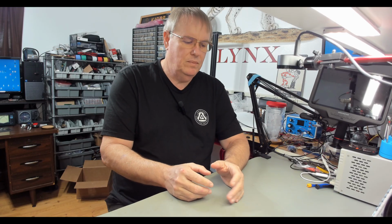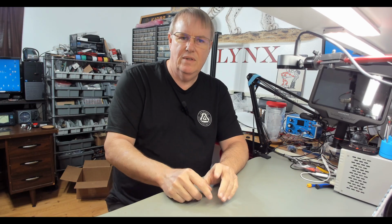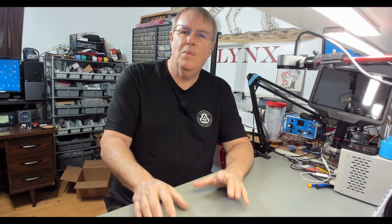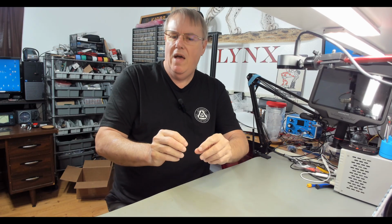So the first thing to point out is the big debate is whether, when you put an antenna tuner in your system, you've got your radio, your antenna tuner, and your coax and your antenna, and your antenna is not resonant, and you tune your antenna tuner, there are people who believe that the antenna and coax changes because of the tuner. It makes a conjugate match that causes the antenna system, coax and antenna, to be resonant, meaning it is 50 ohms resistive, and that's all. There is no inductive or capacitive imaginary impedance in it, and it's just like a perfectly cut antenna that's resonant at this frequency, and it's going to have no reflected energy back because the impedance is a perfect match, and it's just as good as having an antenna cut just the right length.